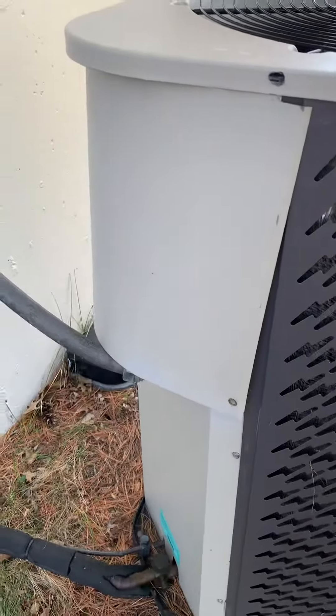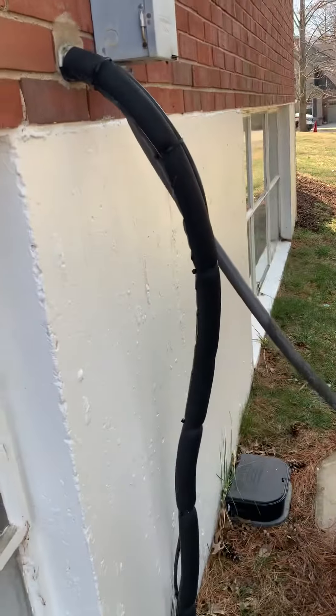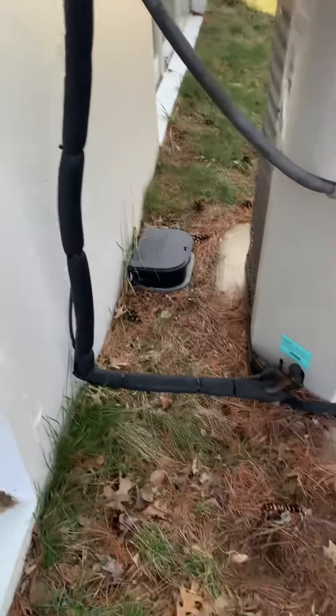This one's struggling — it pulls as tight as it can be. We'll need a longer whip. I told her we'll put new UV-rated insulation over the line set. It looks like we're seven-eighths coming out, so we'll clean this up a little bit too — just make a tighter 90 down and into the unit.